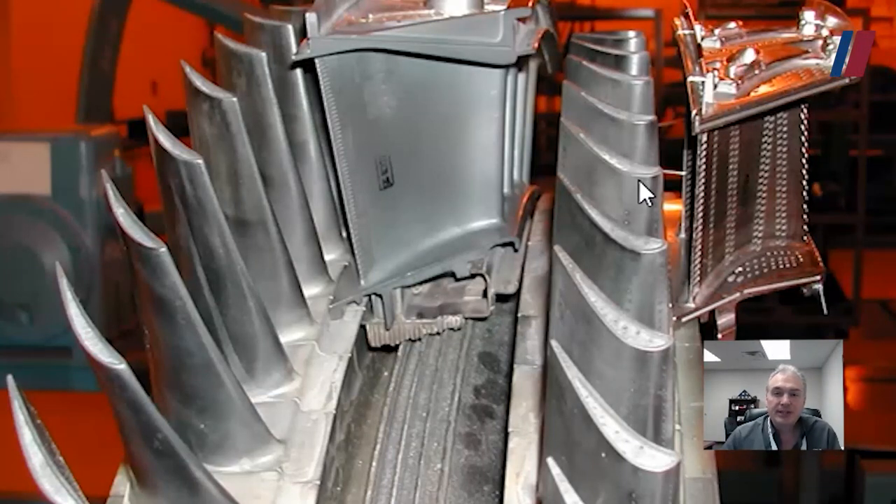Here's a great picture of the HPT first stage blades, second stage blades, first stage nozzle, and second stage nozzle. You can see where the hot gases come in through the first stage nozzle, into the first stage blade, into the second stage nozzle, and into the second stage blade. You can also see the volume is actually increasing as it gets into the second stage. The thermodynamics of an HPT, or any turbine, is basically going from a smaller volume to a larger volume. As you move away from the hot gas source — the combustor — you're losing energy, so to catch that remaining energy downstream, you need a larger catcher's mitt. That's why the second stage blades are a lot bigger than the first stage blades.